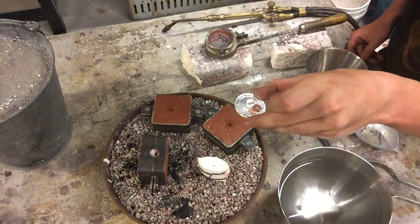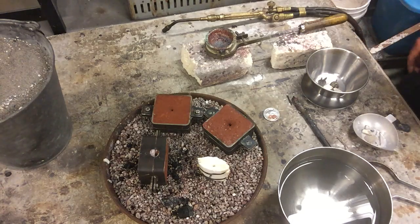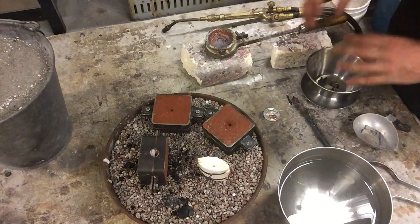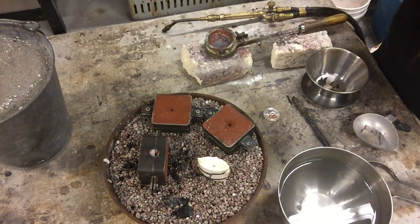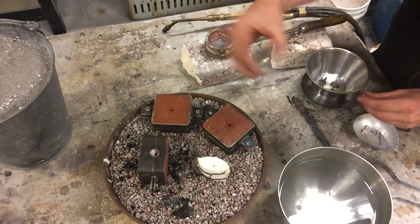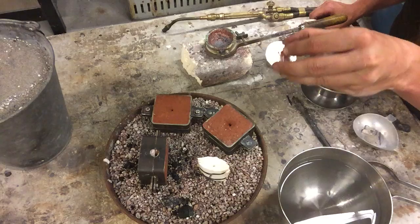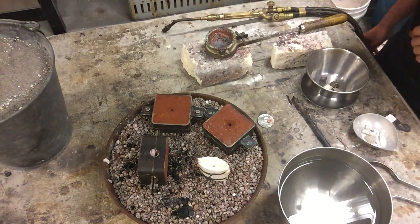If you're alloying new metal, that counts as new. When you're alloying, remember to do the weight at seven and a half percent copper and ninety-two point five percent pure silver. If you've got 99.9 fine silver, you just want to make sure that the remaining is just under seven point five percent so you can stamp sterling on that alloy.